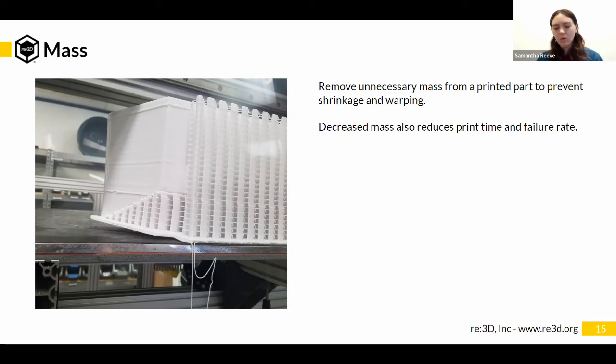The goal is to make the geometry you need while using an infill and material that will still get you to the actual geometry you intended. Things you can do to increase the chance of success: you can decrease the density. A lot of a part's strength comes from the outer shell, and some from the infill.